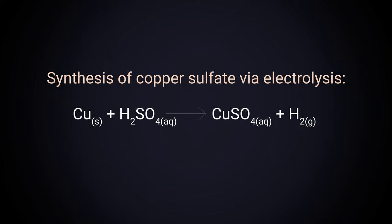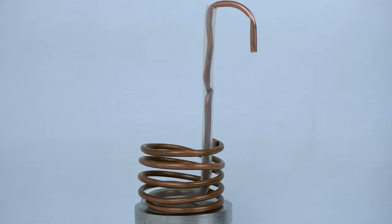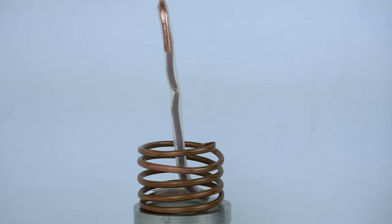The electrolyte I'm using is 6 molar sulfuric acid. This is the same solution used to fill dried charged batteries and can be sourced from most auto parts stores in the U.S. NurdRage made a great video of this process and recommended setting up the cathode well above the anode, and we'll start with the same setup. There's a link to his video in the description if you're interested in watching that as well.